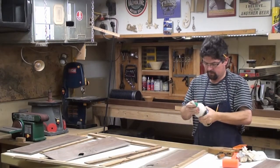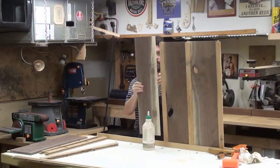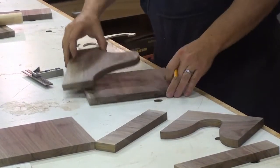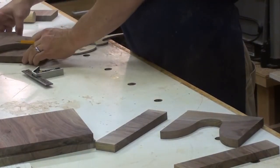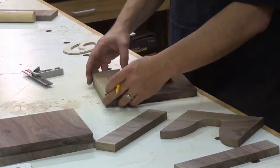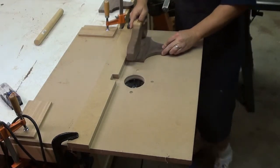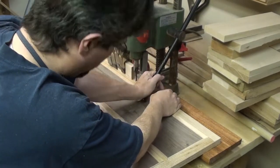It is time to put some panels together. We are going to make sliding doors with shelves on them, and under each shelf we're going to be able to hold a towel and some paper towels. We're laying them out and cutting some dados to hold the bottom of those shelves. Let's use mortise-and-tenon joinery to make these puppies strong.